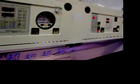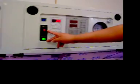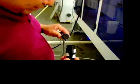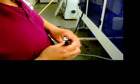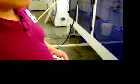Now we can see here that we have a carboy. The carboy doesn't have to be in use. We have an adapter for it. So if the carboy is not in use, if they want to drain the tanks, they have to plug this adapter in order to drain the tanks. Also make sure that the tanks are not too hot to be drained, and the plumbing carrying the chemical can handle the chemicals being used.